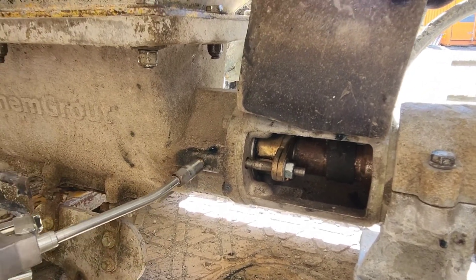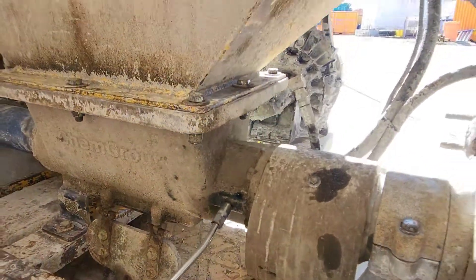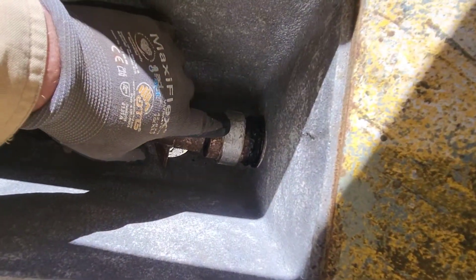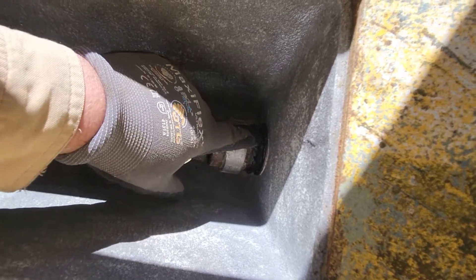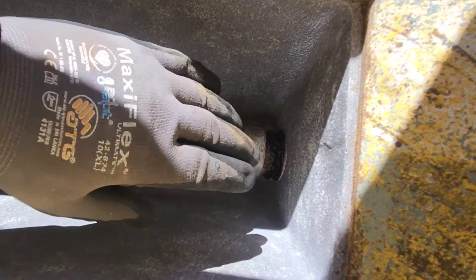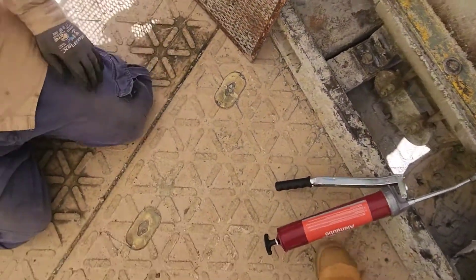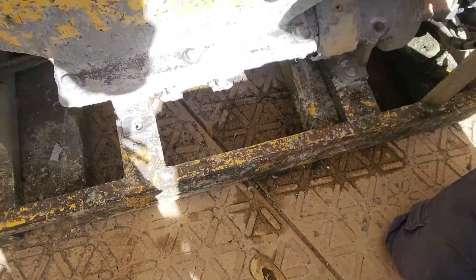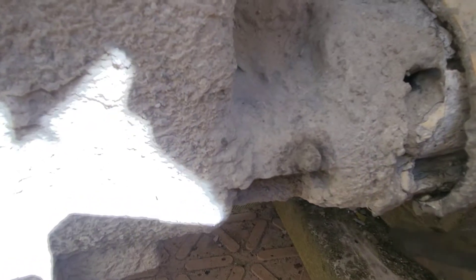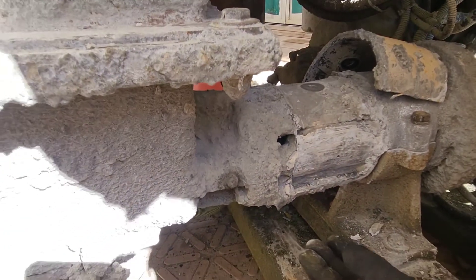So right here we'll pump grease in here, and the way you know that there's grease at the beginning and end of every shift is you'll see it inside of the shaft or inside of your hopper. You'll see the wet grease, and this is keeping the grease as a seal so your grout stays in your hopper and doesn't leave the hopper. When you don't do this every single day, you'll see on this grout machine — here's the exact same greaser, here's the same housing — and it's a solid block of concrete, because this has never received grease one time.